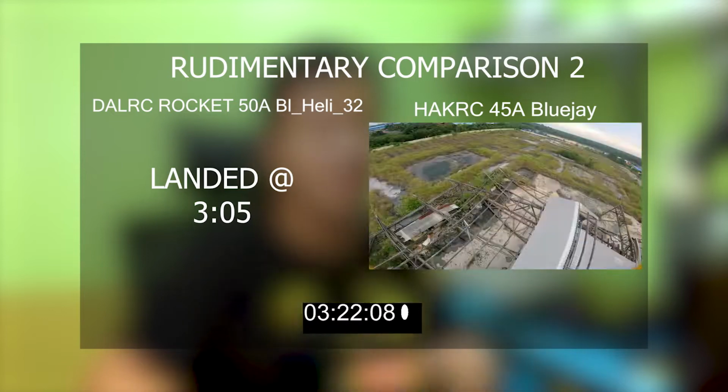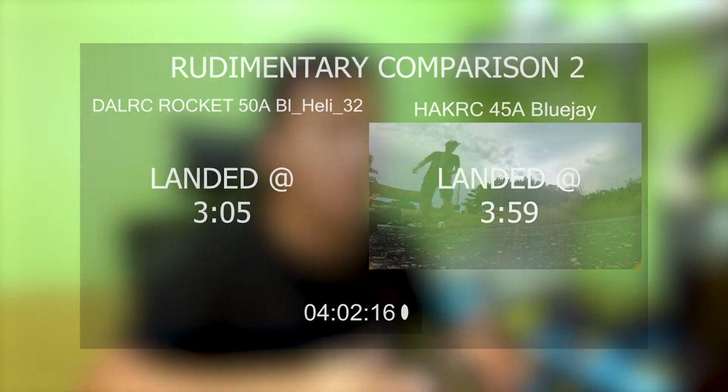And it's so weird to see my good electronics and motor build getting outperformed by this basher build just because of Bluejay. The other things I noticed is that the quad also tends to land with cooler motors. The flight feel is also much smoother. And I don't have a butt to rebuttal this. Every time I install them in any of my quads, they just perform better than whatever I've built, which might actually be a testament to me sucking at programming a BLHeli_32 ESC.